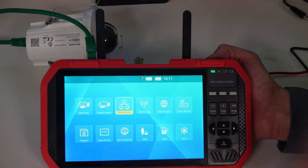Pressing mode again: OPM — the optical power meter. Using the fiber connector shown earlier, connect it on and it allows you to test the fiber. You've got different wavelength settings, dBm, mW, hold display, calibrate, record data, save the report, etc. — all specifically for testing fiber. Press mode to go home.